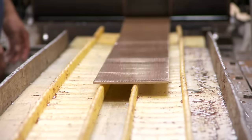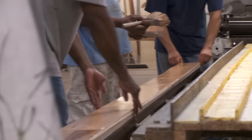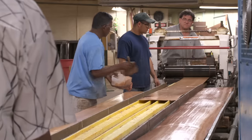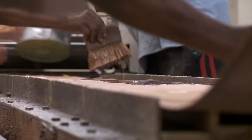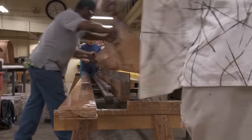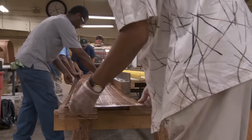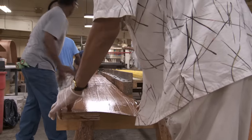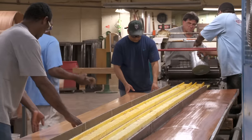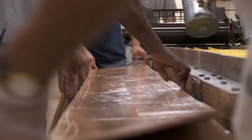Straight-grained hard rock maple is laminated and glued together in flat-grained sets. Flat-graining gives a 47% improvement of vibrational characteristics over cross-grained, plywood-style sets. Steinway's unique system is to bend both an inner rim and an outer rim at the same time. This is the method that achieves ultimate strength and durability and the quality of sound distinctive to Steinway.